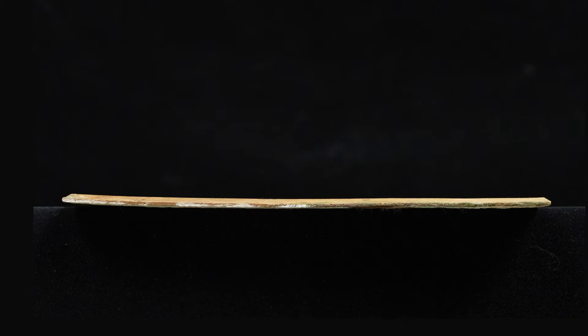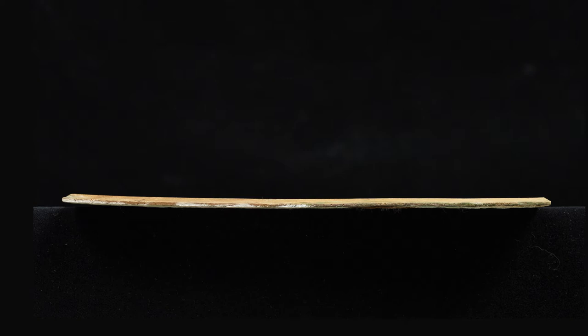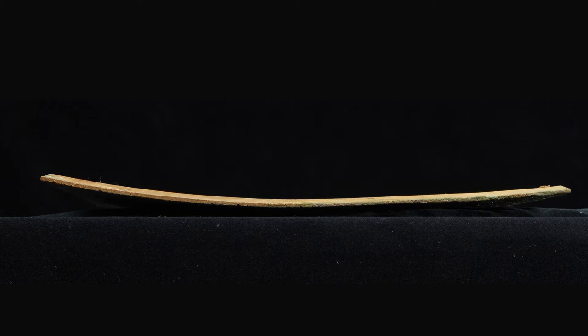If one of the panel surfaces is sealed by a ground layer and then painted, that side of the panel will be slower to respond to humidity changes. In this case, the painted surface is face down. The unsealed or unpainted surface will absorb and lose moisture much faster, and movement on this side will be exaggerated in comparison to the sealed surface. The warps result when the humidity is low: as the wood of the unpainted side loses moisture, the wood cells shrink and the panel takes on a curved or convex warp. Even if the panel is later exposed to higher humidity, the warp will never completely disappear.